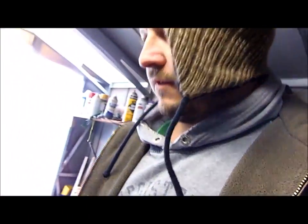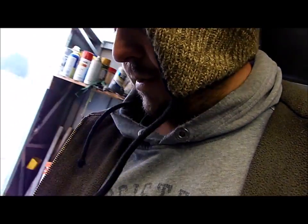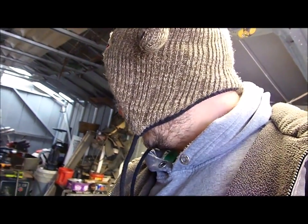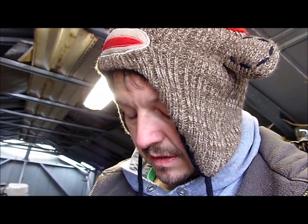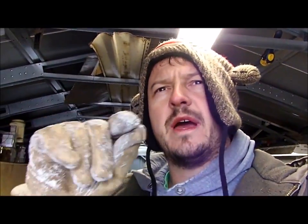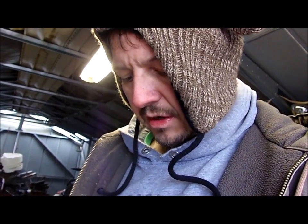And I'm going to try and feed this to the lambs, because I don't really want to be buying a ton of pellets. I was thinking I might put the pellets down through in with it as well. Maybe the way to have done it would be to cut a little slot out where I put that little shear on, just above the sieve, the bit where I melted the edge off a little bit. If you could make that adjustable in and out, say, 1/4 inch, that would be the way to do that, because you could adjust your cut a little bit.